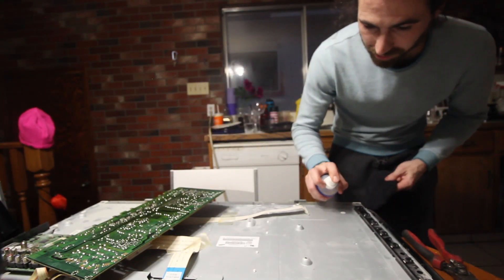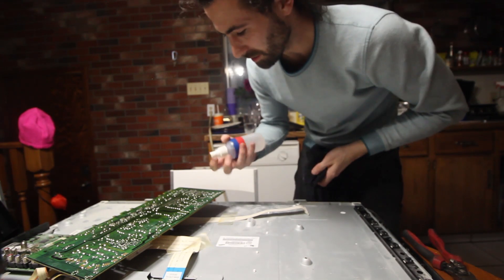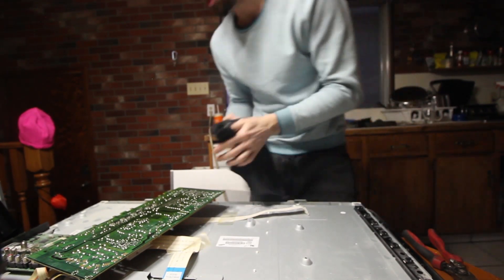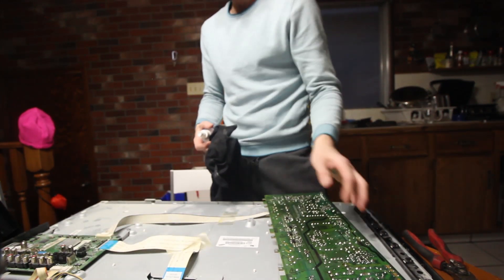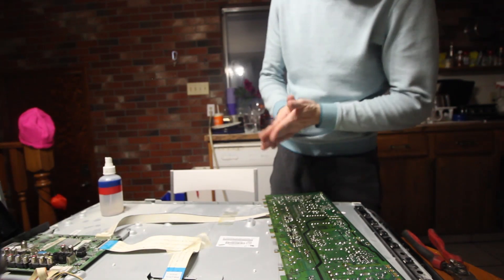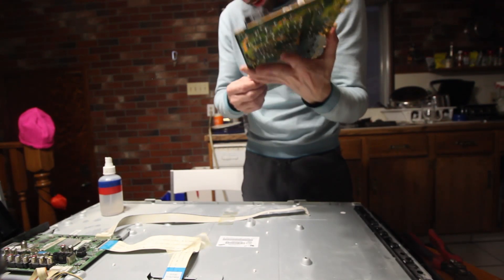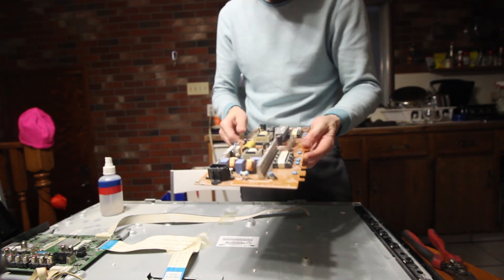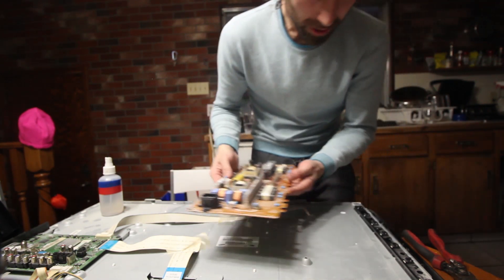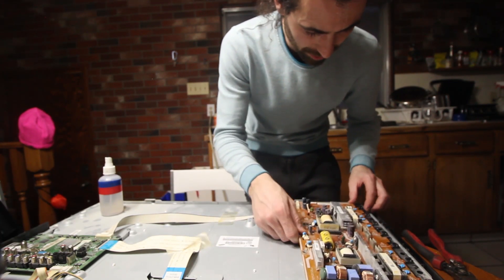If anybody was watching this for soldering tips: the rosin toothbrush works just fine. Isopropyl alcohol cleans up that rosin afterwards, because it's a greasy mess. And DIY solder wick is fine - there are better products on the market, but it's fine. That looks pretty good with its nice fresh caps. I didn't replace this tiny one or this one, because these were the ones that all of the people on the internet were replacing with good results.